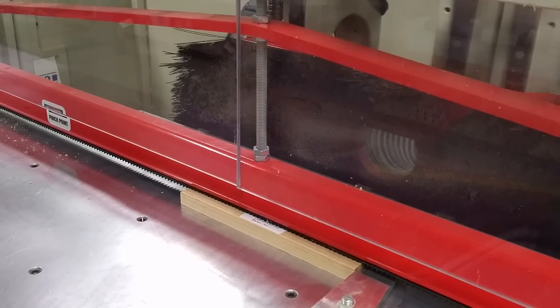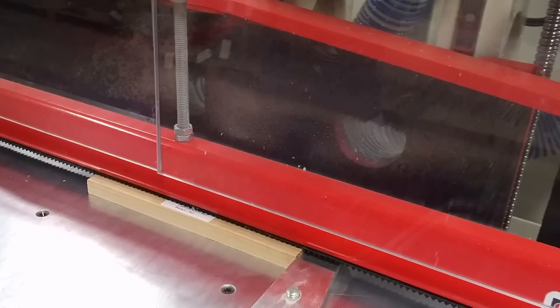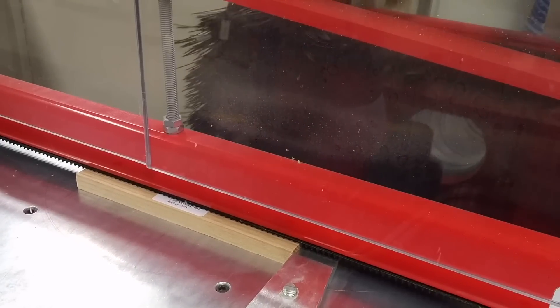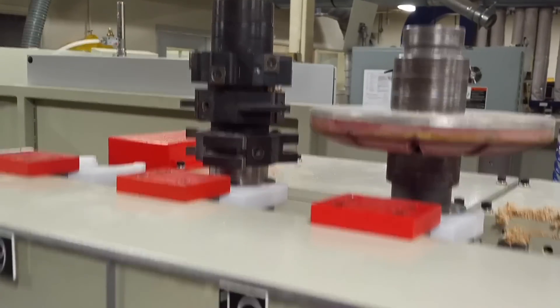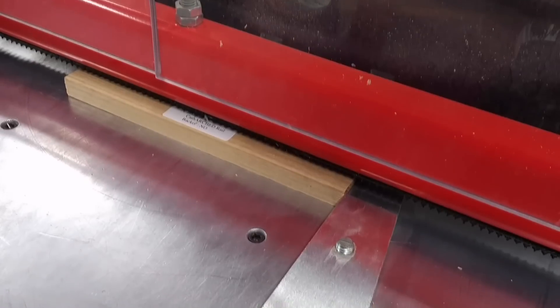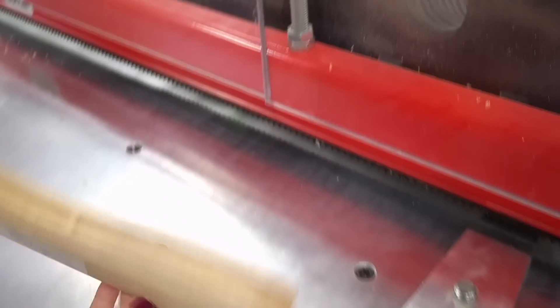It's presenting itself and saying it's ready. She's going to go ahead and put that part in there, clamp it down, and start the cycle. Now we're going to see a bead profile cathedral. That noise is it actually doing a hogging cut first. We can set up hogging cutters. Actually, he took that all in one cut — he had that one programmed all in one cut.